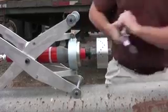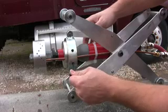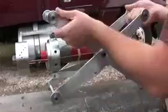So that the tool is centered in the pipe, adjust the scissor carriage so that it is firmly seated inside the ID of the pipe. Tighten the allen nuts and then insert the tool into the pipe to make sure it fits.